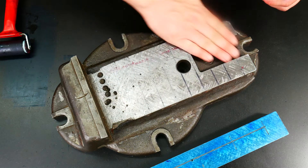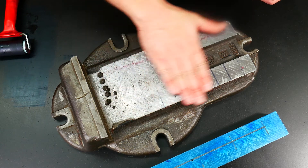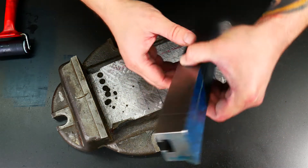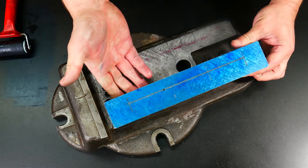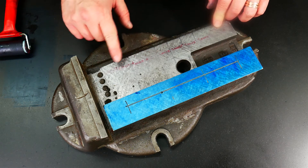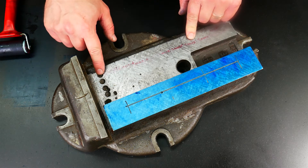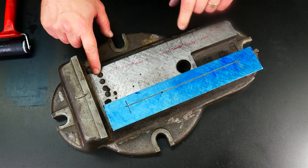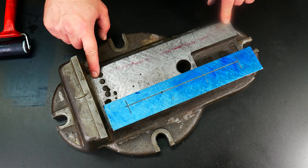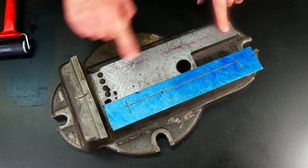Now we check that the part is clean. You do this by hand because your fingers can feel features down to about one ten-thousandth of an inch. If it's dusty or dirty, you'll feel it. Take your gloves off and do this by hand — I know you get messy but it makes for a better part in the end. We're going to place our straight edge down. You might be able to see there are marks on here — they're a little faint because it's been wiped over, but essentially we're about half a thousandth low here, and about one and a half thousandths high here.